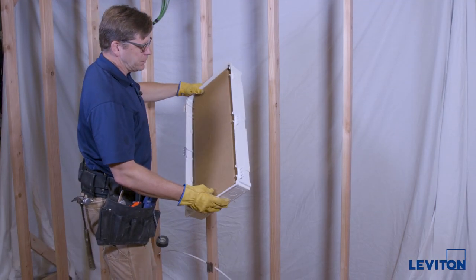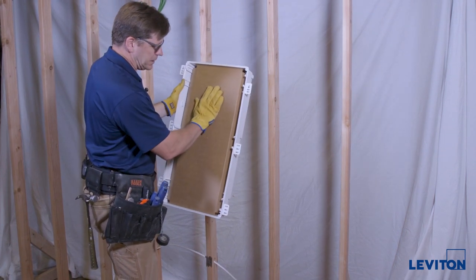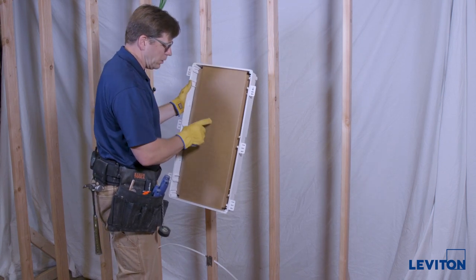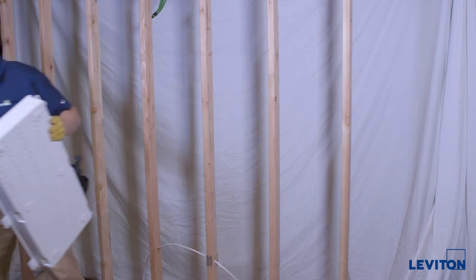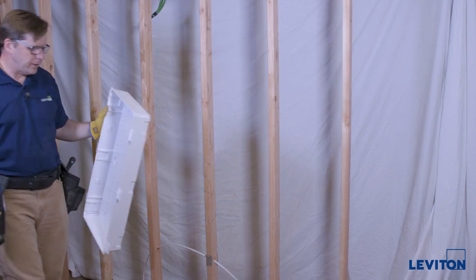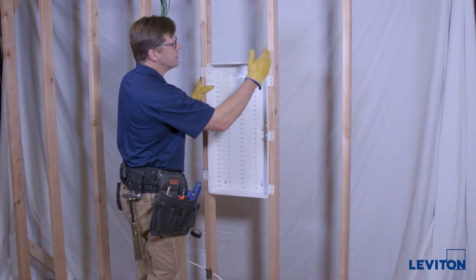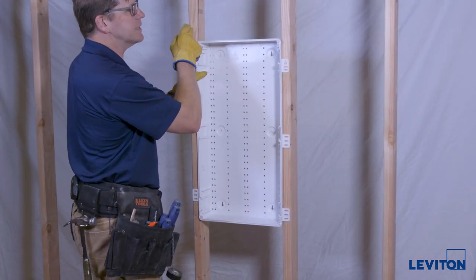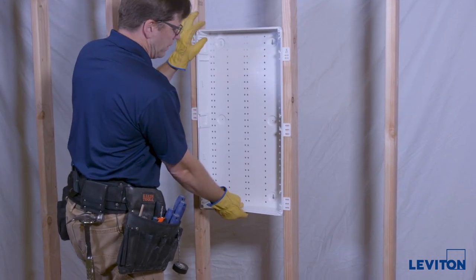This is the 28-inch version of the wireless RF transparent enclosure. The first thing we need to do is save this part — this is installed in the enclosure as a mud guard and we're going to need this later. For right now I'm just going to pull it out and set it aside, but don't throw it away. It is not packaging — it is something that we're going to need later. You'll note on this product it sits right in the stud bay. These are 16 inches on center; from the center of this stud to the center of this stud is 16 inches, so this space is about 14 and a half inches, and that's what it's designed to fit into.